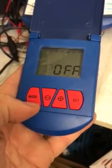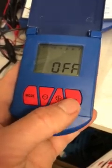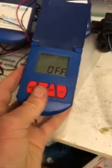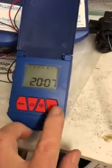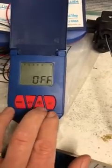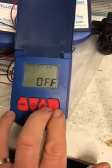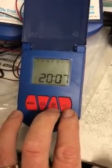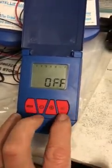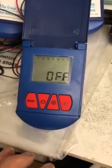So now that won't flush at all. If you want to override the flush manually, hold down the set button and at the same time press the plus button — that will override the timer and open the valve so the urinal will flush. If you want to stop it, hold the set button and press minus. All right, I think you have it now — good luck!